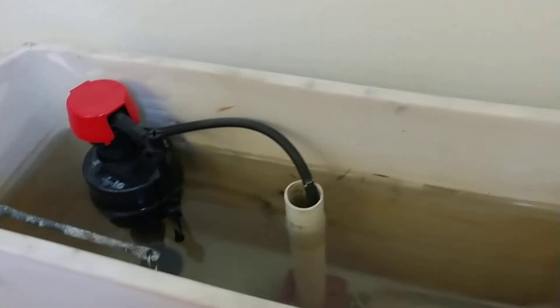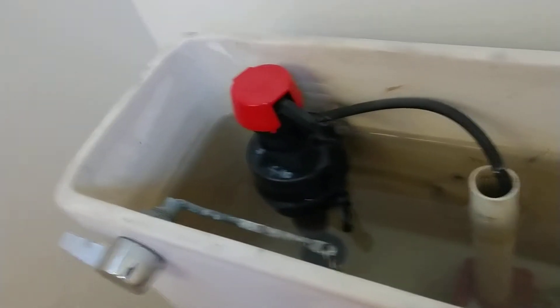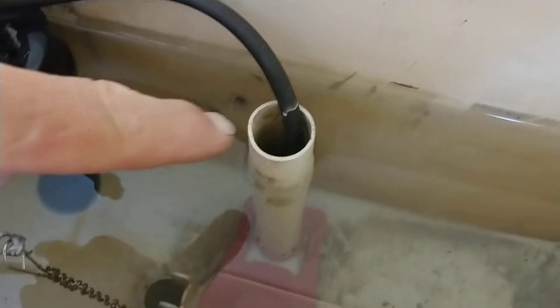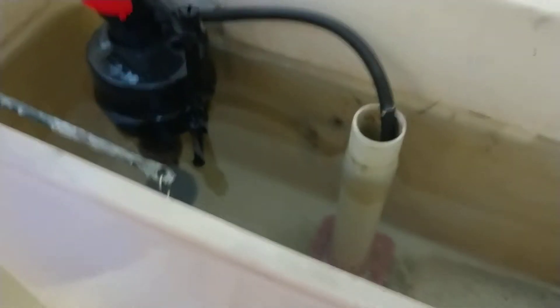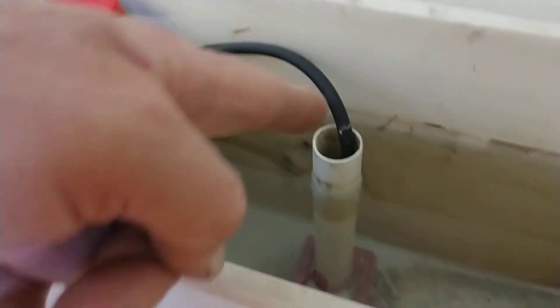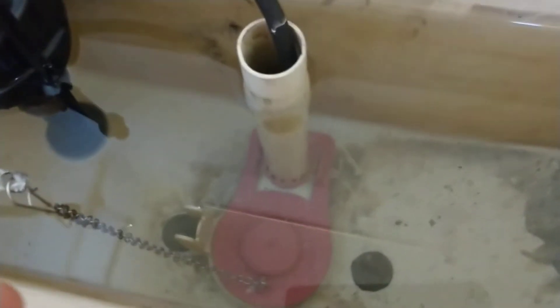This is something I have never seen before — I just stumbled across it. It's a good reason to have a headlamp on when you're inspecting things, because the only way I would have ever seen this is if I could physically look down the fill tube. What's going on is this is siphoning water backwards and draining the tank. The guy has been trying to fix the flapper over and over.